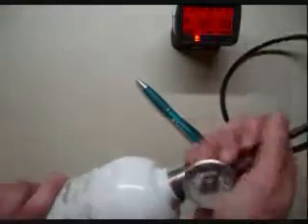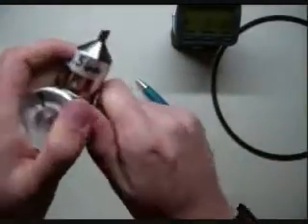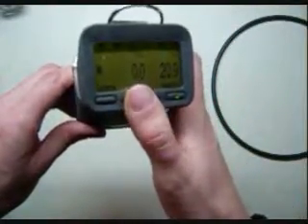While that's going off, unscrew the regulator. You don't want to leave a regulator on top with cal gas — occasionally there are leaks, and occasionally impurities inside the regulator will react with the gas. Nothing good can happen when you leave the regulator on there. Try and leave the regulator open, just in case the next person doesn't know to do that. Your unit is now back at the normal screen with a zero for the LEL and 20.9 for the oxygen.